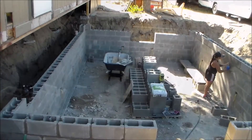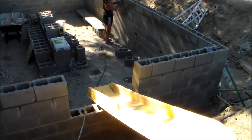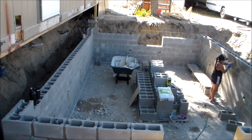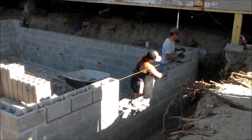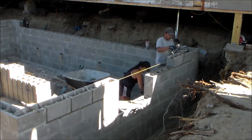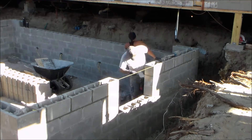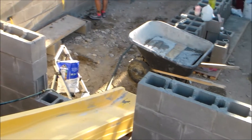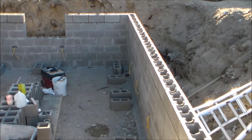Now I'd like to share a bit of the building process for the middle and top bond beams. Here's a look at the middle bond beam course — at this point we're pretty close to being halfway done. I've got a couple of corner blocks in place, and two stretches still to get done — the back and the side. There's no vertical rebar visible here because I have to add some rebar extensions once I get a couple of courses higher. This opening I'm working next to will be for one of my windows, and here's another window opening on the opposite side. As you can see with this course of bond beam blocks, I have a pathway for my rebar to run inside and go around the corners from one window opening to the next.